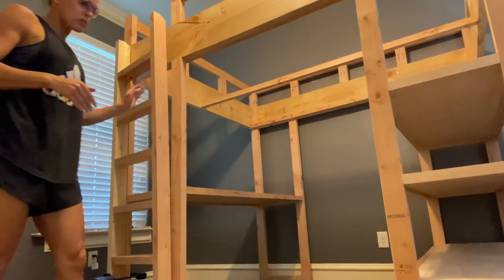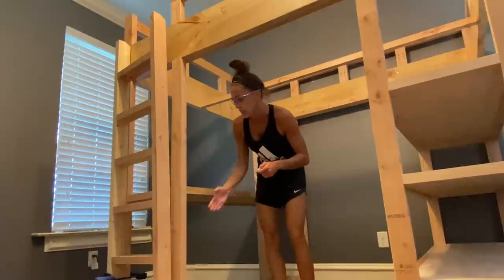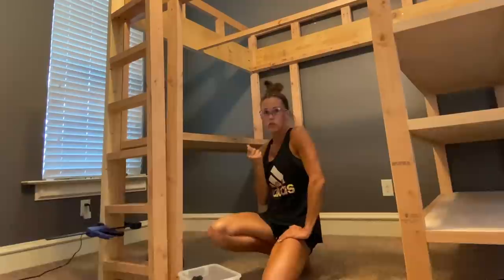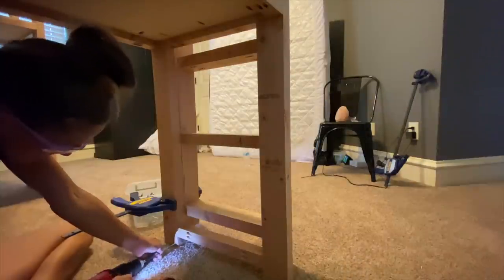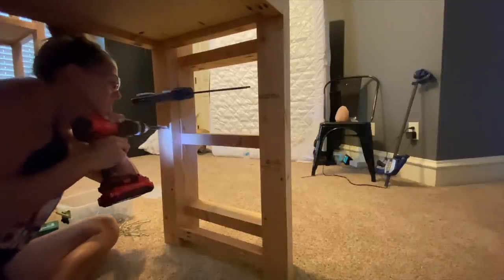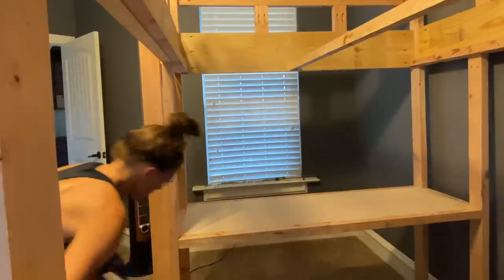I have the ladder up here and I decided to go ahead and attach the ladder to the loft bed before painting it, since it wasn't going to make a big difference either way. I'm using three inch wood screws, attaching them from the inside of the front legs into the ladder legs all the way up. These boards are a little bit wonky because I used scrap boards since I ran out of lumber, so I'm hoping the three inch screws will pull it nice and snug with the clamps. I'm going along the inside and using my clamp wherever it's not flush and needs to be pulled tighter.